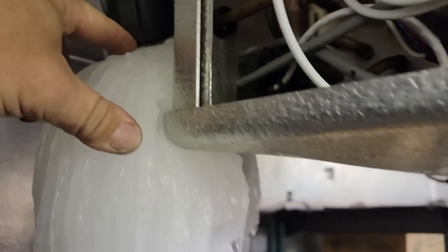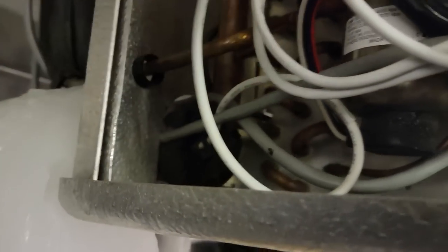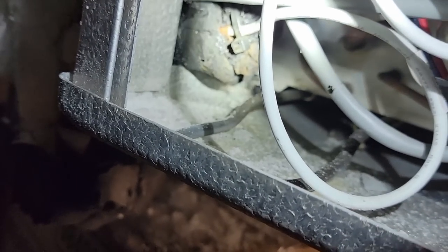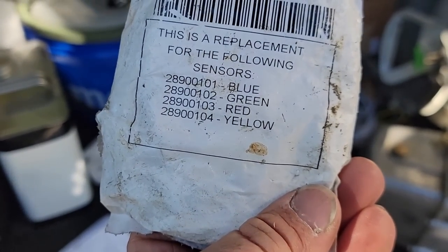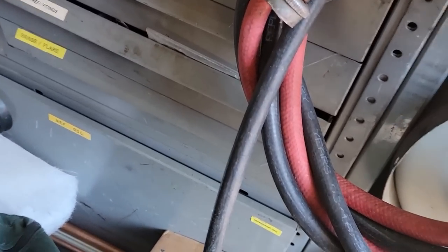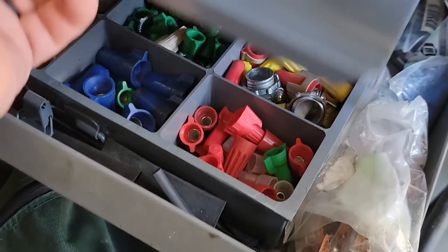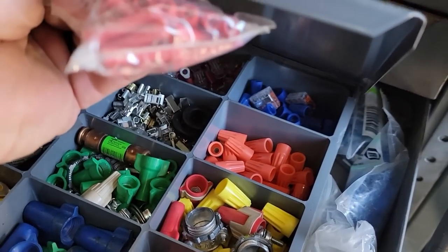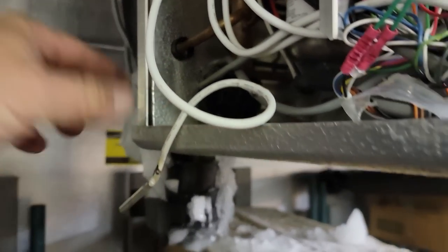We're trying to dig out the old sensor — it's got ice all around it back here, which is great. It's really stuck in there tight; it's in a copper well. I'm going to get my hand torch out and put a little heat on there. I was able to break off some of that ice. I didn't record it because it's hard to do with both hands, but I just used the torch, kept it away from the sensor, let the radiant heat get over to it, and was able to pull it right out.